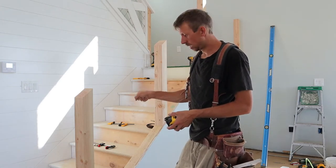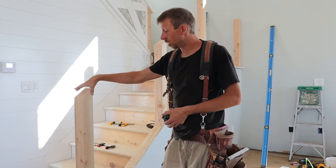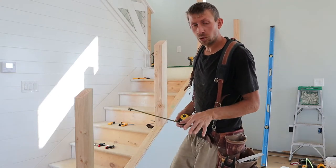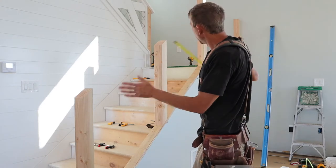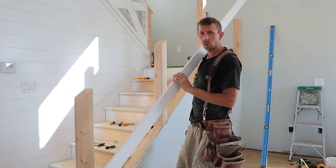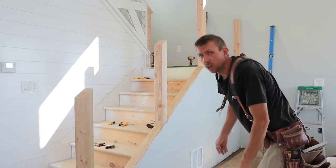That's what code says is the right height to grab. I am going to be putting a two by six top cap on, which is wider, but since I'm going to be a little higher I'm going to put a handrail on the inside later, so I'm not worried about it. What I'm going to do is make my elevation marks, take a straight edge, clamp it, make marks, take my post back down, go cut them, and then come back and mount them after I get the right elevation.